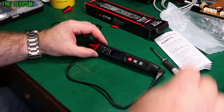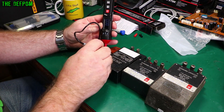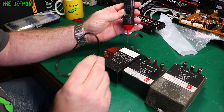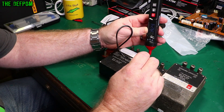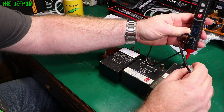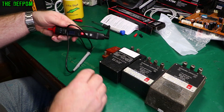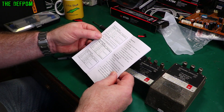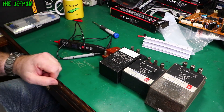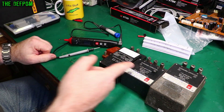Capacitance: starting with 200pF — not showing up. 1nF — not showing up. At 20nF there we go, you can see it. It's doing 19.2, so it's off by 80 counts. At 1 microfarad it's only one count out — pretty good. The manual says plus or minus 4% plus 5 counts. It looks like 20nF is about as small as you can practically measure.